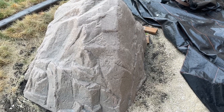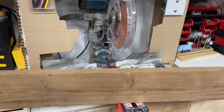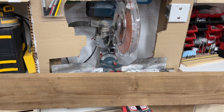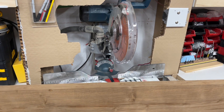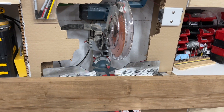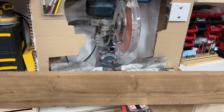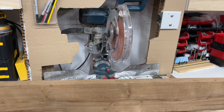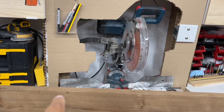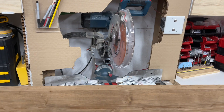I did some calculations - the outside diameter of that lid for the septic tank is just about 36 inches wide. By the time I figure in some space to get it over the top and a little bit of extra space to get in at the fitting for the electrics where the motor attaches, we're looking pretty much around 40 inches across. On the internet I found an octagon calculator - an octagon seems to be my best bet because it's going to give me fairly tight tolerances, and where the two ends come together that'll give me even a little bit more distance coming down.